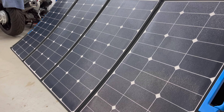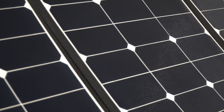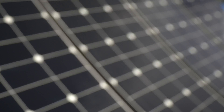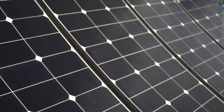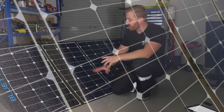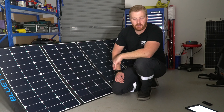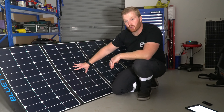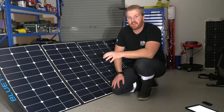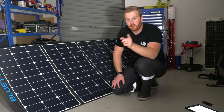Now that we've opened it out, we can see the design and construction of the solar cell. This panel uses a high-efficiency monocrystalline solar cell referred to as sun power — hence the model name SP. The SP cells are able to capture more sunlight as they do not have grid-line electrical contacts and incorporate a solid rear copper backing, resulting in less chance of cracking or fracturing with movement or expansion and contraction with temperature changes. The panels also have an ETFE laminate on top, one of the most durable materials for solar, reducing the chance of scratches, damage, and yellowing.